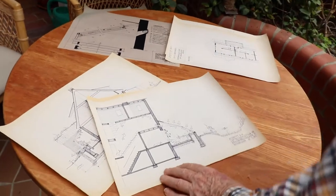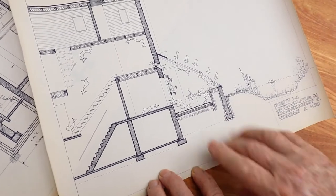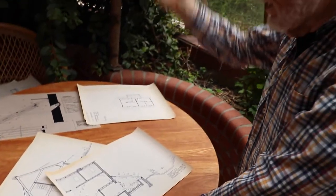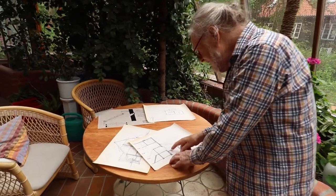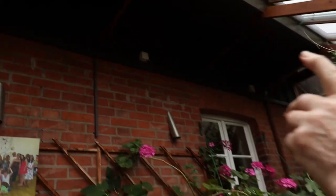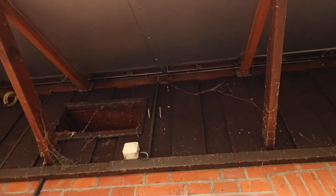This is where we're sitting now in this section here. You can see the air is warmed with the double glass and with the earth registers — the earth register brings in the air and it warms and goes up, because hot air rises. We keep the windows closed but can also get in the warm air that's in the greenhouse. There's a hole in the wall up there to allow air into the first floor.